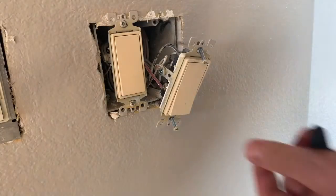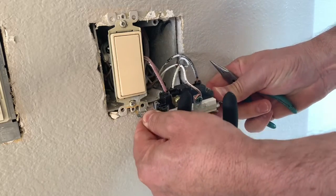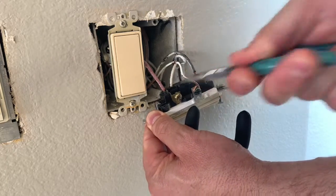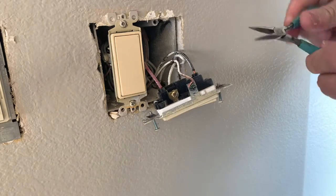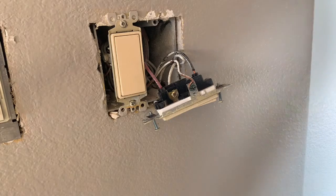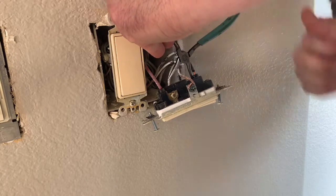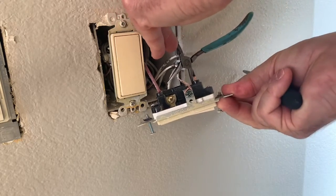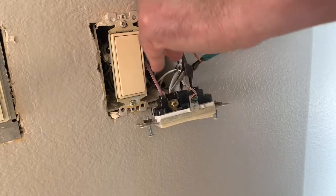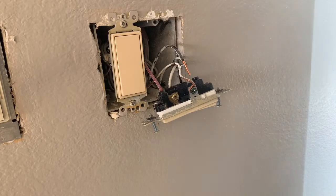With the power off, you have to get the wires off the old switch. These are in push fittings. You can either use the push fittings or wrap them around the screw heads. With the push fitting you need something very small and stiff to get into the hole — I've got this tiny little pair of pliers. Push that in there and it should release it. You can see that wire is out. I'm just going to do that with the rest of the wires and put the new switch on.